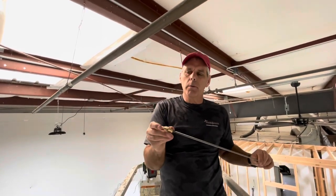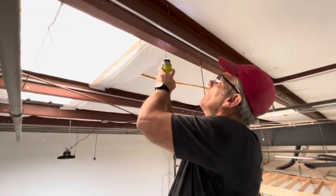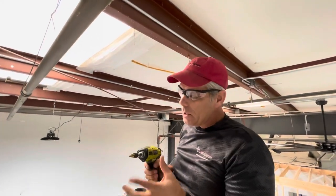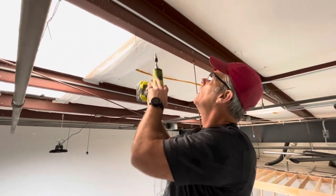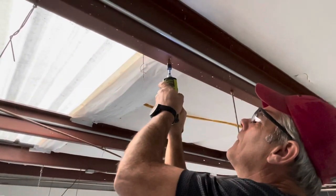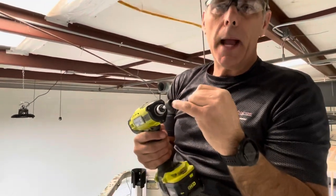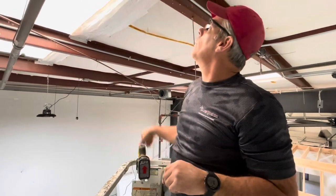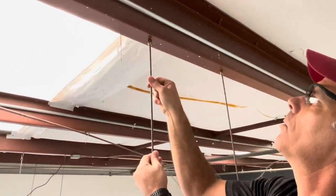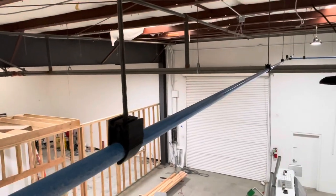Our steel up here is a little thick so we struggled a bit with the self-tappers, so we're just pre-drilling the holes first — put your safety glasses on because you've got metal coming down. The self-tapper worked but took a while, and a few broke before going through. Also, go buy a good nut driver — don't try to use a socket. It's got a nice magnet, holds tight, and works really well. Once the bolt is in, the hanger just screws right into the holder.